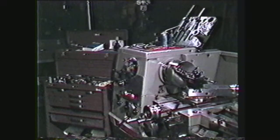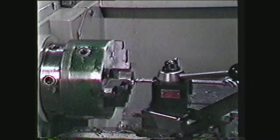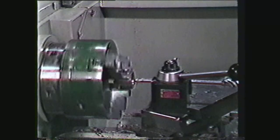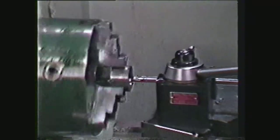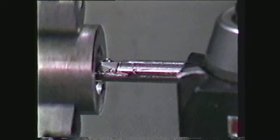When working in the machine shop, always wear safety glasses. Remove rings, jewelry, and watch. Keep sleeves rolled above the elbows. Run the machine at a low RPM with a minimum amount of tool overhang to prevent chatter and tool breakage in the machining of internal threads.